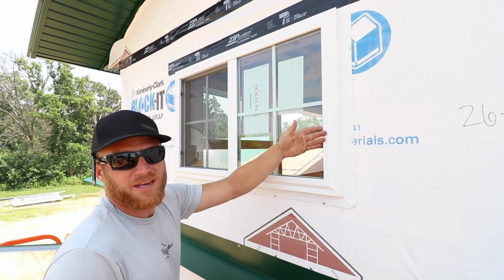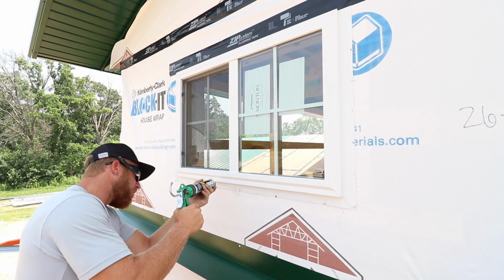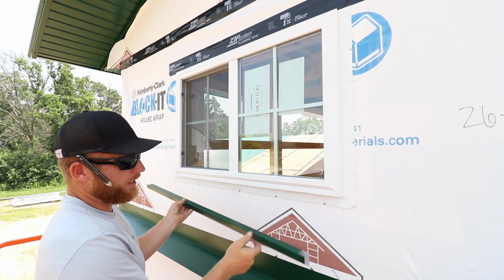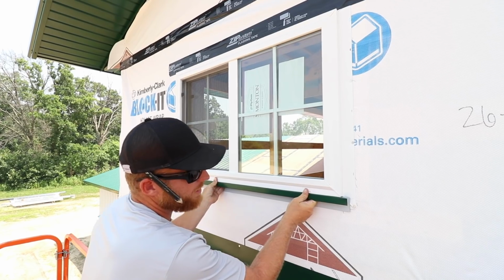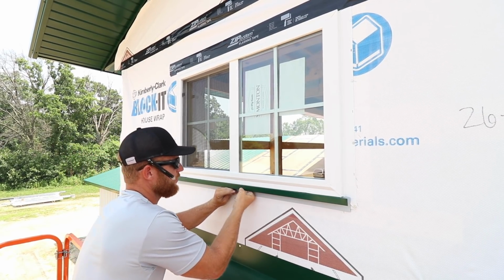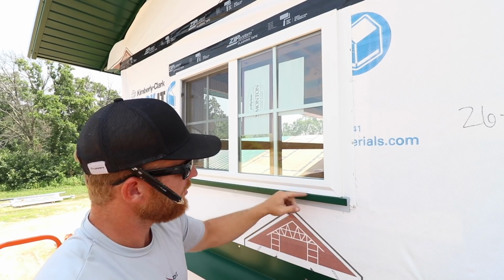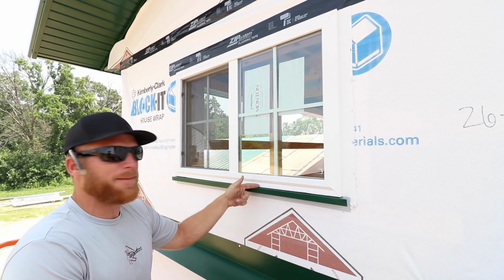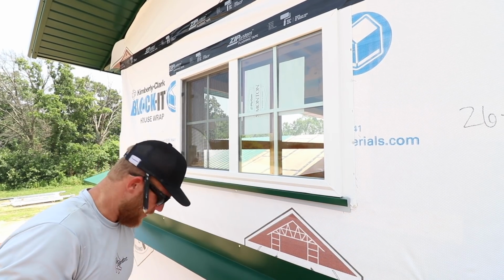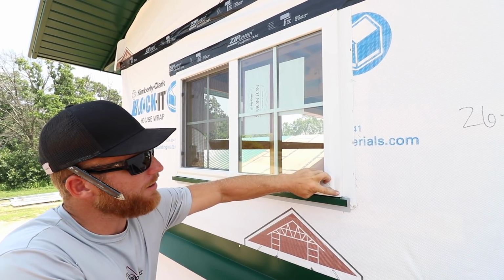So at this point, the water that can come in here is going to be able to come down the window and work its way back in. So what I do is run a little bit of a longer bead of sealant. With this sealant here, my hope is there's just the slightest of a lip, and I'm going to put this J channel up. I'm going to push it into that bead of caulk and push it up nice and tight. What that's doing is creating just the slightest of pitch on the top of this trim, so that any water that gets here, if it does go in, is going to hit that bead of sealant and stop. As you see, I ran my sealant long over here, and then I'm going to do another joint for my sides, and that'll kind of complete it, allowing any water that gets behind here on the connection to come down and then work its way out.